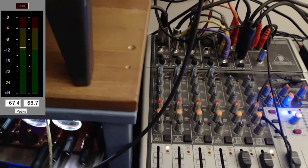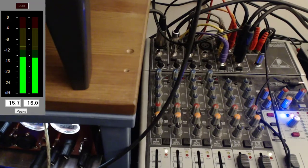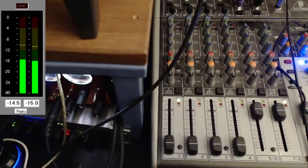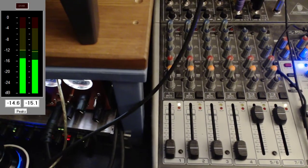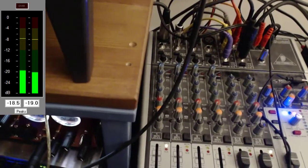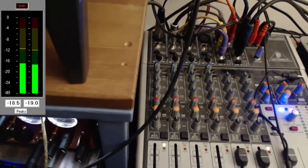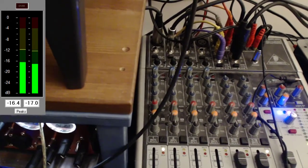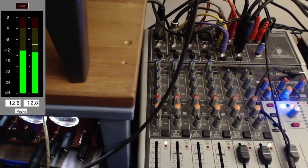And all of this audio that you're hearing right now is actually going out of the auxiliary port. Whatever's going into that microphone, as you can see, I've made it so that on my mixer panel, it's muted and the volume slider's all the way down. I'm only using that one channel there to amplify the sound of my microphone, and so it's going to go out of the auxiliary jack. You may have a dedicated preamplifier, but in my case, I only want to use it to preamplify the microphone and split off the signal and send that over to another few devices.